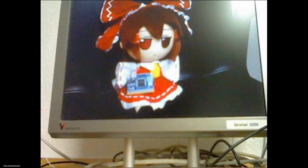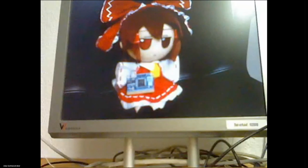Anyways, image. It's a simple one-page plushie driver. Yeah, it's less than 100 lines of code right now. If you discount all the commented out stuff for the color bars, it just displays an image. Unbelievable. And in fact, you could probably make it higher resolution if you wanted to. There's nothing in here that's specific to 640 by 480. At the top, you have the constants that you can change. You'd have to change the NCO value somewhere, maybe.